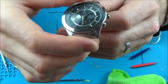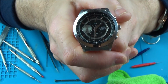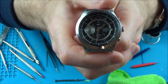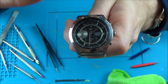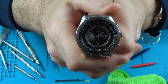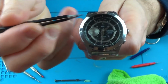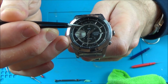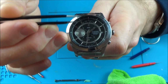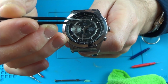In hindsight now, what would I have done differently? Well, the thing I would have done differently, and I've been told this before, and was also told it recently by Mike from My Retro Watches, is to take a picture on every single step of the way. But I sort of thought, because I'm filming, it would be okay, but it wasn't okay. And I'll tell you the big problem I had. The white gears were in different locations, and they looked almost identical, but they're not going to be identical. They might have a few more teeth or a few less teeth.